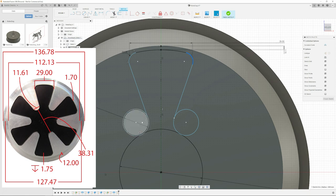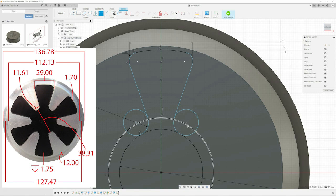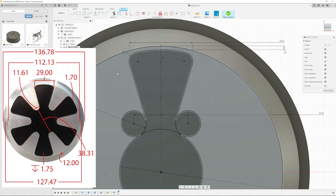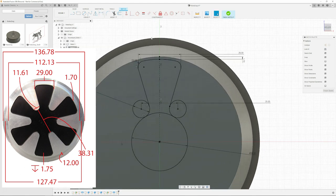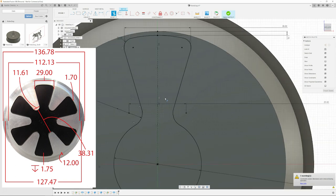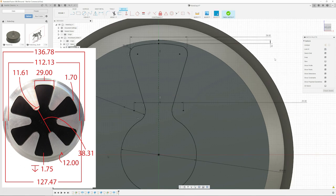I'm going to try to hone in on the accuracy of these motors - you have to be very accurate in robotics. You put encoders on it, accurately measure positions, and you can even get the resistance of the motor and factor that into your control system algorithms so you can move the robot more fluidly by knowing that information.